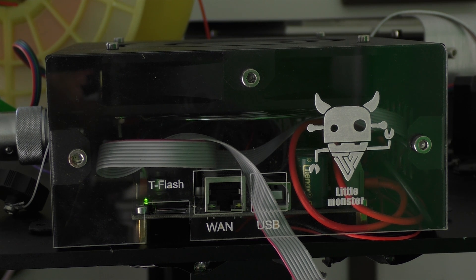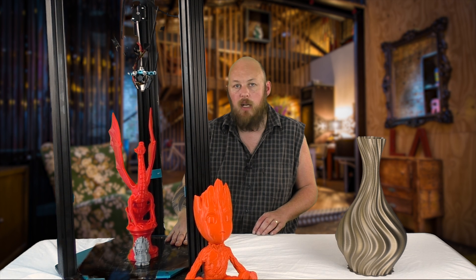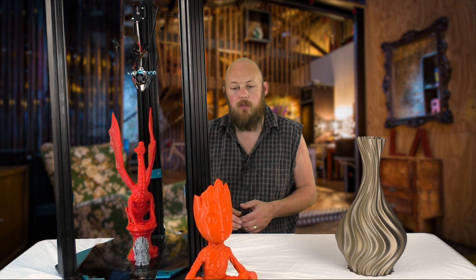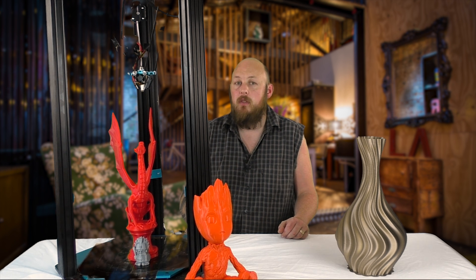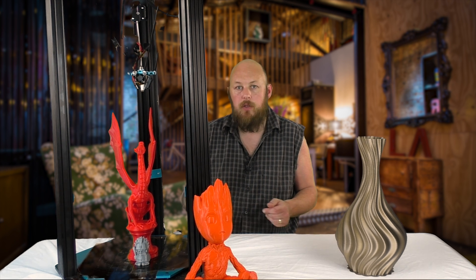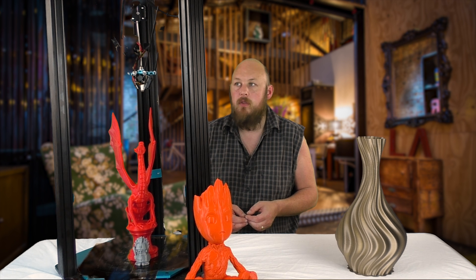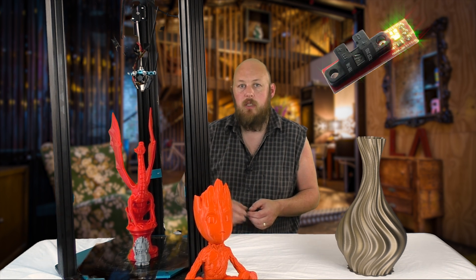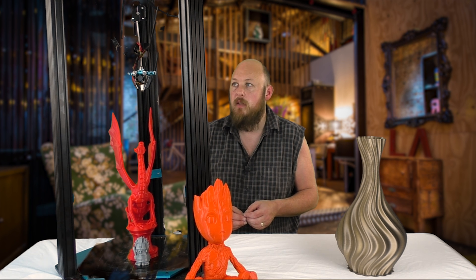Most of the electronics are all up top so out of sight, and I think they've done a really nice job in the way they've laid the machine out. It is very sturdy, very strong build. The power supply also powers the 240-volt silicon heated bed and that will get up to 80–100 degrees in just a few seconds rather than a few minutes on other printers. This has been one of the best out-of-the-box experience printers I've used so far. The build was dead simple — I did it in an hour, hour and a half, with just an 8-page beta manual. It runs optical end stops, which is a nice feature — one less thing to wear out.